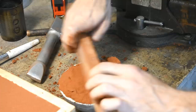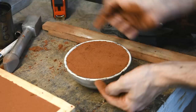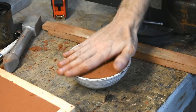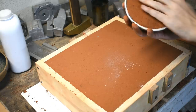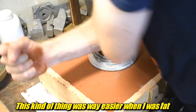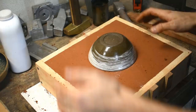This edge does not have a clean sharp parting edge — it's a curved edge. So the parting line is where the curved edge points out the most, which means instead of the top being the parting edge, it's actually down the side like two or three millimeters. I'll show you how I'm going to fix that to make the parting edge level. Going to set it upside down and try to force it down in there. That's not going down. Bowl-shaped recess on the back of a plank of wood. That's a lot harder than I thought it was going to be.